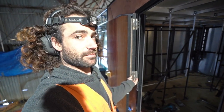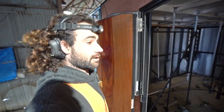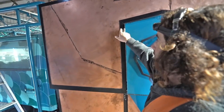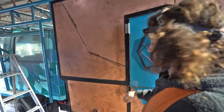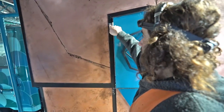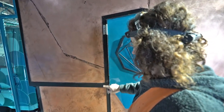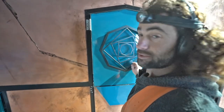It's such a fine adjustment that if I need to change anything, I have to weld the holes up and redrill them. I've already put one top hinge on — I welded a little tab onto the front and notched a bit out of this trim here. Now I can pack this out a little bit, pack the lower ones out in the middle, which gives me a lot more control over the alignment. It's a much better way of doing it. I've tacked it on temporarily and now I'm going to put this one in and the lower one and see how the alignment looks, then weld it out and fix them permanently.